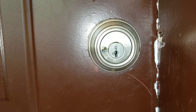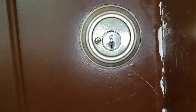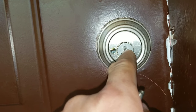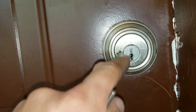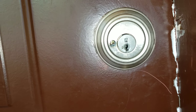I already drilled out one hole right here — I just wanted to show you. Whenever you're drilling out a lock, you want to do what's easiest for you. There are three different methods I've seen people use: some people like to drill right through the lock itself, some people drill right on top of the key slot. The key slot is where all the tumblers are, so when you stick your key in, the tumblers have to match. A lot of times people like to just drill out the tumblers, but I like this method here because it's just a clean method.